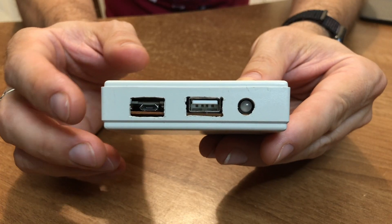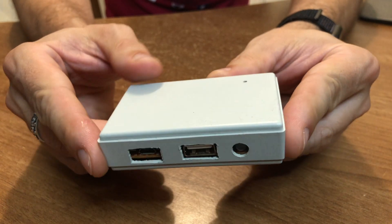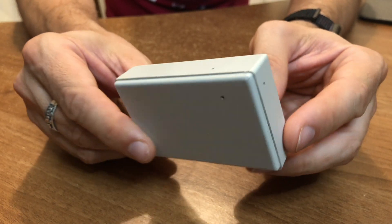There is one final task — this project needs a case. I had of course planned the layout and size from the start. Make sure you have a suitably sized project enclosure and cut your breadboard to size before you start. I've cut out a hole for the micro USB power, another for the USB port for the fan, and I drilled a hole for the LED. I've also drilled a few smaller holes around by the temperature sensor to allow a bit of airflow, which hopefully will give a bit more of an accurate reading. I'll stick the wiring diagram and device configuration up on my website along with a parts list in case you want to give it a go yourself, and I'll stick a link to that article down in the description.